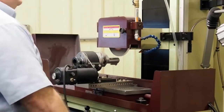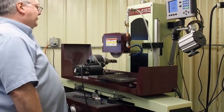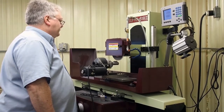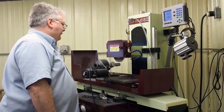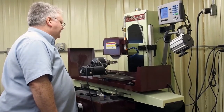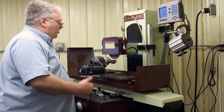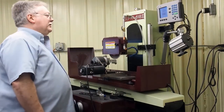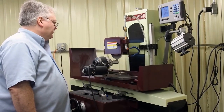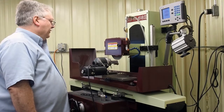I'm going to take between one and two tenths off right now, feeding real fine. You can barely see some sparks coming off it, you can barely hear it hitting. I'm going to go all the way past the back side of the wheel so that if there's any high spot on the wheel I'll be sure to capture that. Then we'll blank pass back.